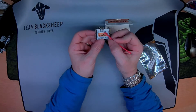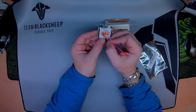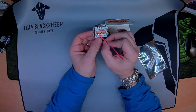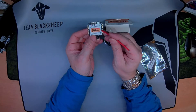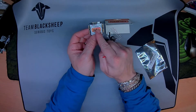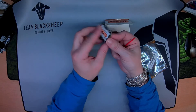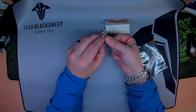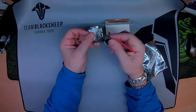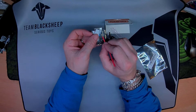Under here on the left hand side you have the scope for an LED output, but you could resource remap for a soft serial for telemetry, for example. And if you need 3.3V Spectrum Satellite, you have that input just here under the label. Those pads there are for Spectrum, but you might be able to utilise that as another UART.